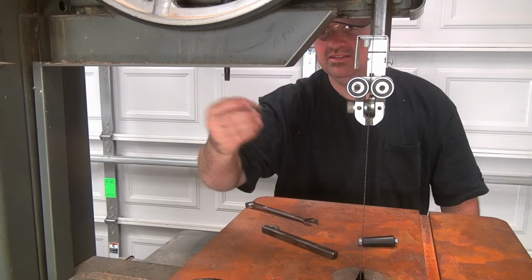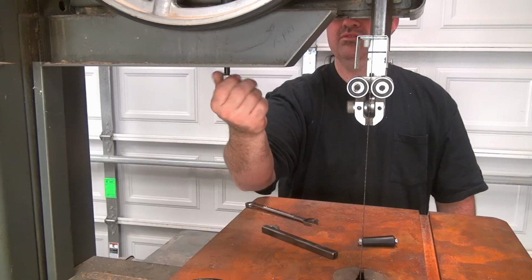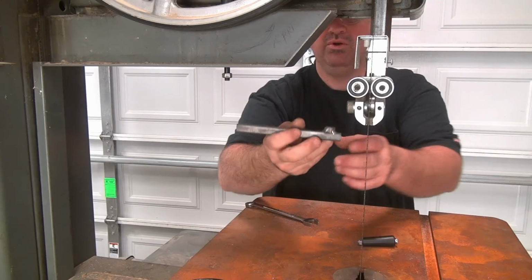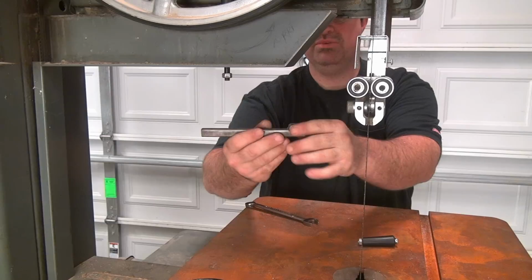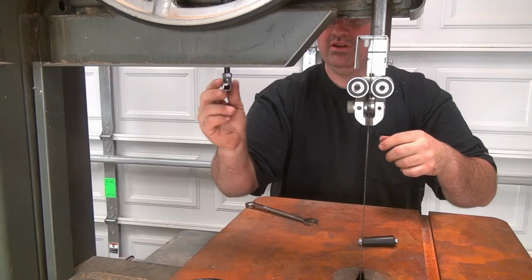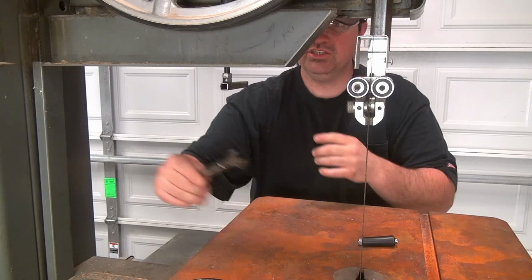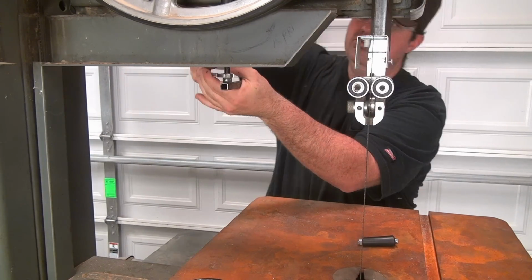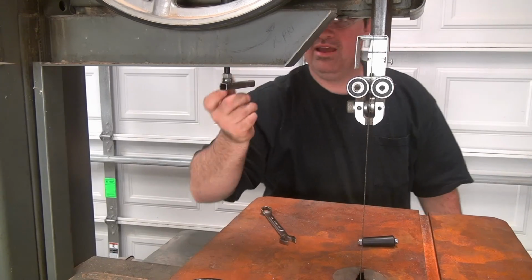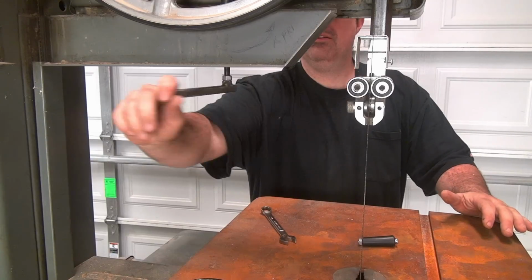And the way it works is I'll put the first nut on, the original nut that holds this down. I'll put that on, and then I welded another nut, the same threading, on this piece of square tubing here, 1/2 inch. When I put it on, before it bottoms out, I could take the wrench here and tighten the one onto another. And by doing that, now I've created a handle of its own.